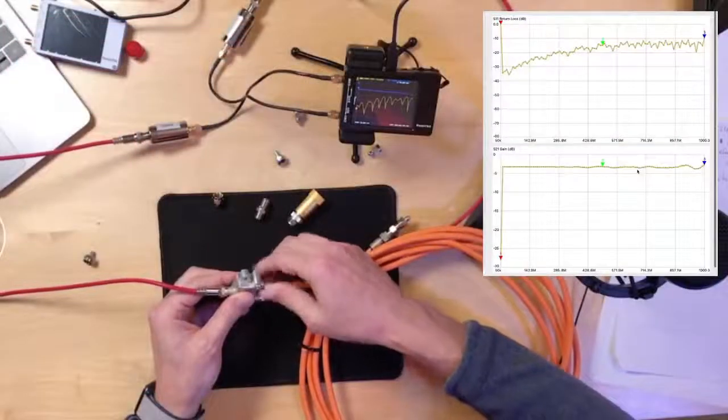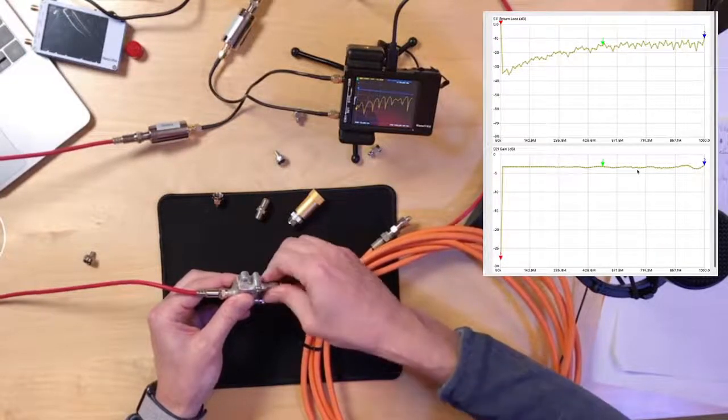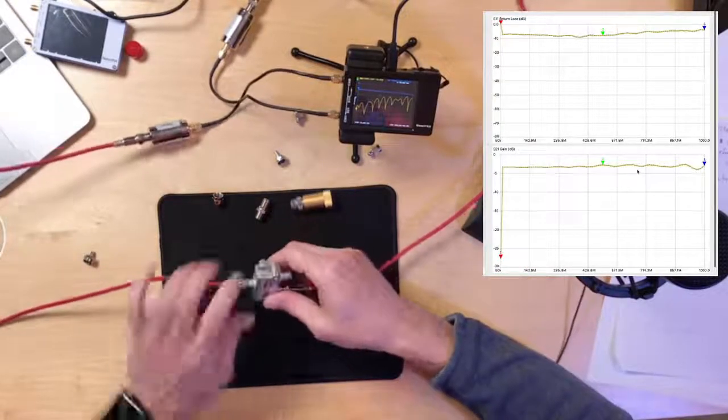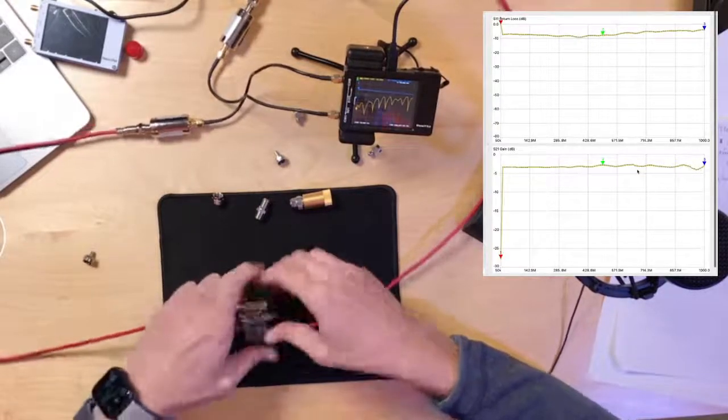All right, so those are our pre-equalizer ones. So loose connectors, splitter port-to-port isolation? You just went through the splitter for insertion loss and an unterminated port. Right. So port-to-port isolation, we can do that. How do you want to do that, John? In and out with two red wires. Yeah, go two red wires on the two output ports. Terminate the input port.